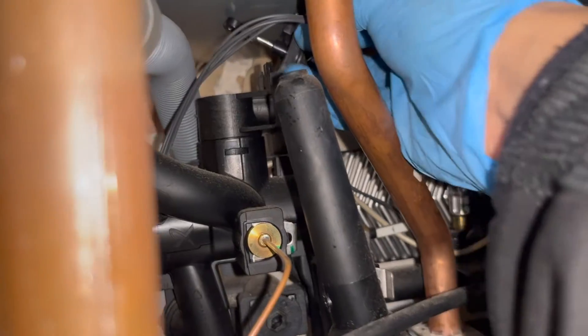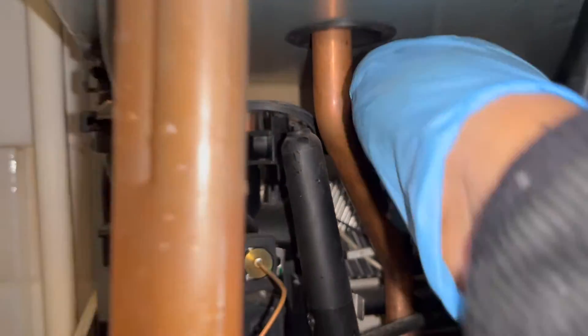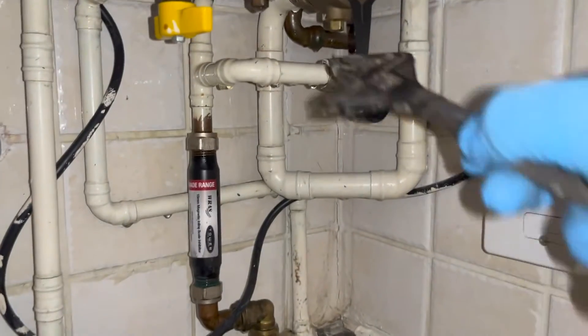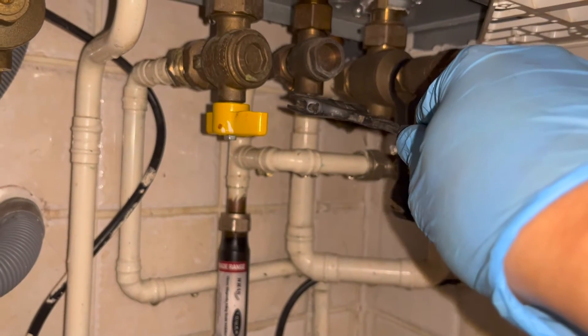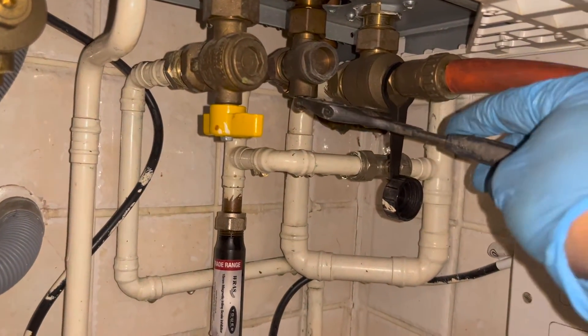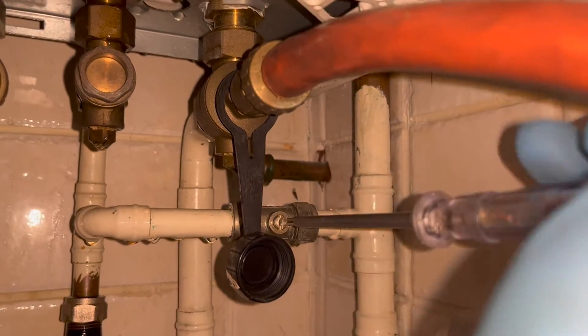The condense trap is all sorted — next I just need to pop the motor back in. Now I'm going to shut the drain off and unisolate the cold. Like I said, if the boiler wasn't the highest point for you, you'd also need to unisolate the flow and return — but for me I didn't need to do that. Just shut the drain off, unisolate the cold, and we can see if there are any leaks. No leaks on the cold water or hot water circuit.